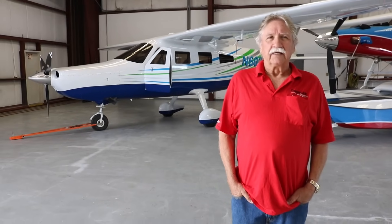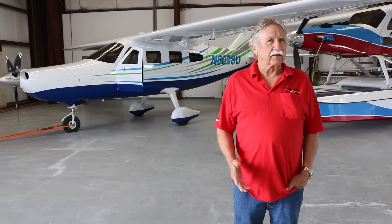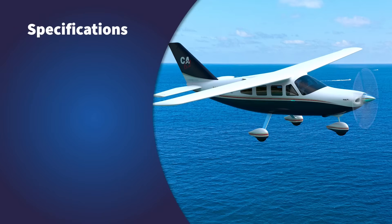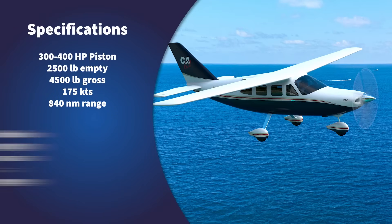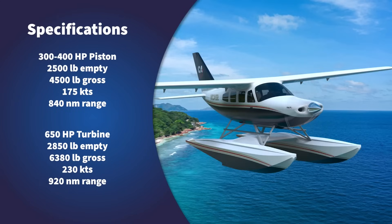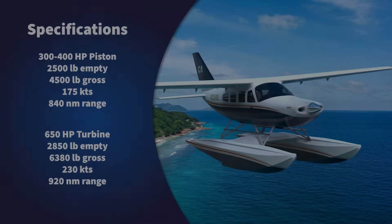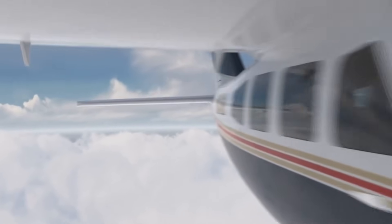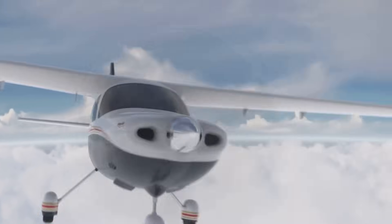If you guys want to join us on our Patreon page, become patrons of this channel — just search on Patreon for Experimental Aircraft Channel. Sign up for several different levels, and at certain levels we even have scheduled video meetings once a month. The performance envelope of the airplane is a 64-knot stall speed. Cruise speed depends on your altitude — this is a turbocharged engine so I do like to fly high. Even at 15,000 feet it's about 185-knot cruise. Up to 21 or 22 thousand feet it goes up to about 190-knot cruise speeds, and at that you're burning 19 gallons an hour. It carries 100 gallons of fuel, giving about an 840-mile range with IFR reserves.